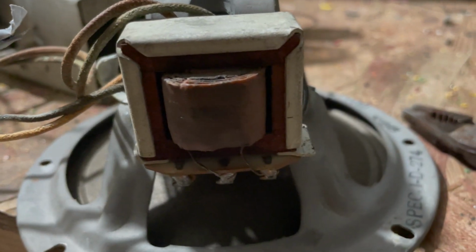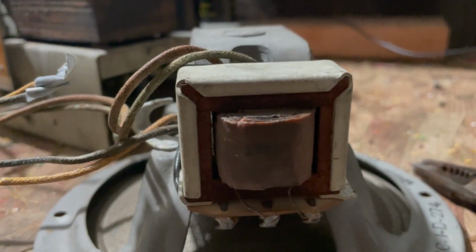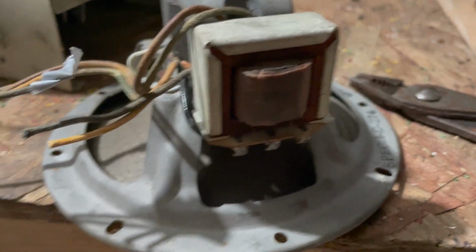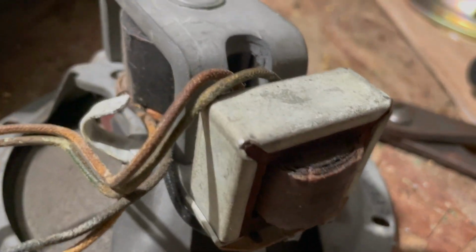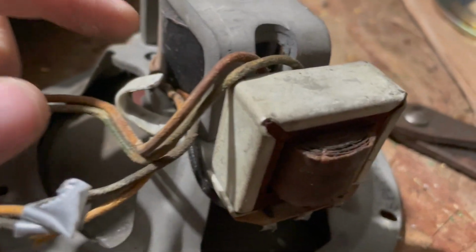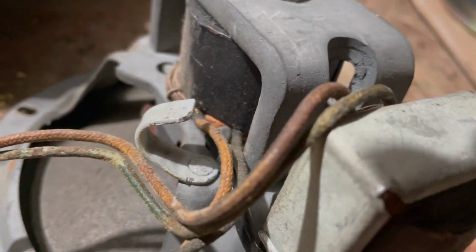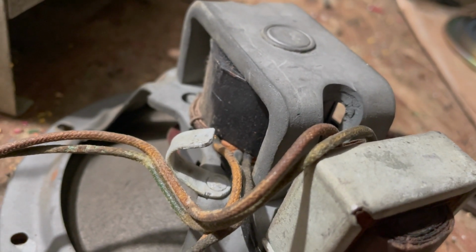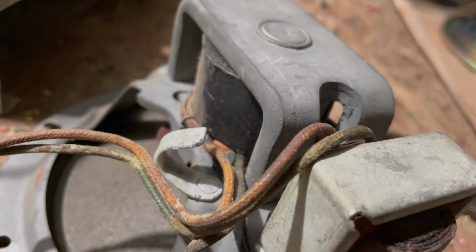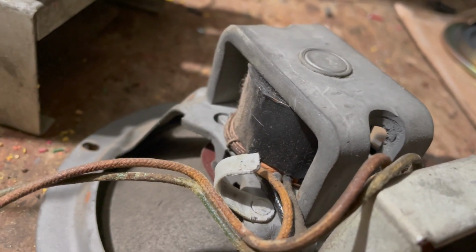The next step on the Emerson is getting this old output transformer off the speaker, which as you have started doing, is kind of difficult. At some point, I may want to try and investigate the speaker, and I'm gonna hang on to it. I don't really feel like doing it, but basically what I can do here is remove some of this paper wrapping and see if there's a break in the field coil close to these wires. And if so, the idea is I can repair it or possibly just trim it there and put a new wire on it and use it with a few less turns. Doesn't really matter that much. That's a possibility down the road.